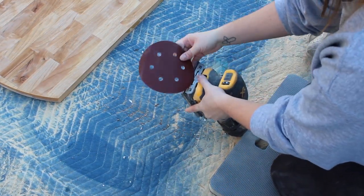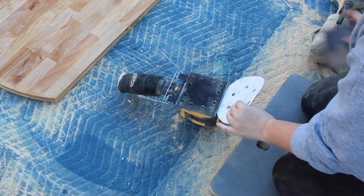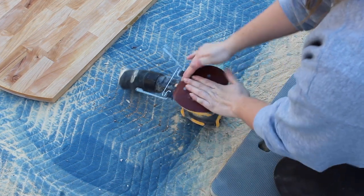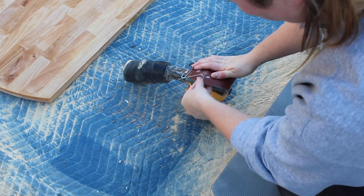The sides of this tabletop are curved and rounded, so I'm gonna use my DIY surf prep hack, where I just put a sponge in between the sandpaper on my palm sander so that I can sand around any curved edges without flattening them out.